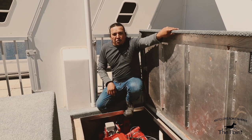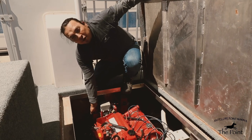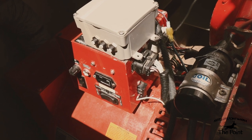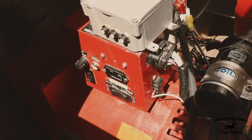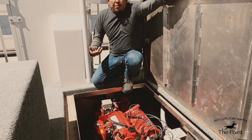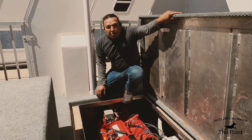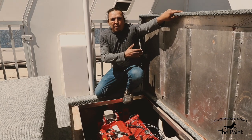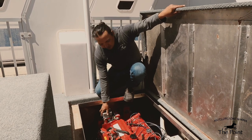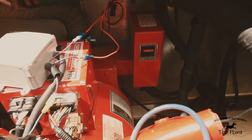If your generator doesn't fire up at the main control panel, you can reactivate the start sequence by shutting off your main on/off switch here — press down to off, then back up to on — and from there start the generator at the alternate start/stop switch by pressing and releasing. You also have a series of breakers. If your generator is on and running but you don't have power to the main power panel, check this series of breakers and make sure they're all reset, as well as the red breaker on the generator — make sure that is in the upright position at all times.